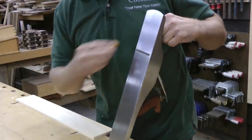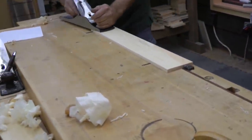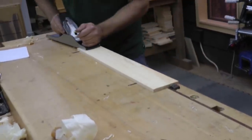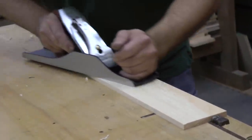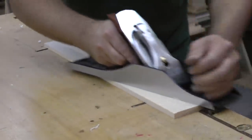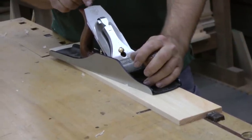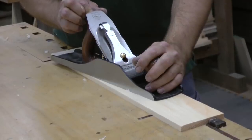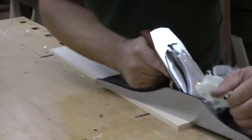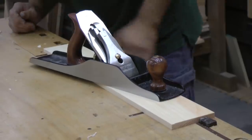Now this is how I would typically do it — the other day we were starting with a fairly rough surface, but when I've got a semi-finished surface, with the blade fully retracted I'll start planing. Then while I'm planing, I'm going to start advancing the blade by spinning the adjuster knob clockwise, and I'll watch to see where the first bit of shaving comes out to determine whether the blade truly is parallel to the sole. It appears I'm a little bit heavy on one side, so I'm going to skew the blade by pushing the lateral adjustment lever toward that high side. The nice thing about having a bearing on the end of that lateral adjustment lever is it makes this adjustment nice and smooth and precise. The less expensive style planes, it's just metal grinding on metal and makes that procedure not quite as precise.